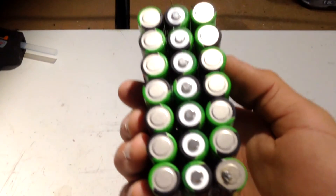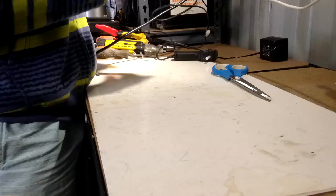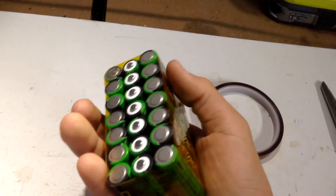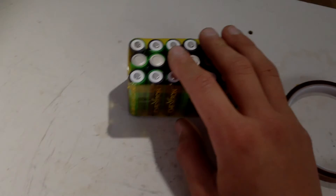The pack is nicely glued together — not exactly straight but it's a nice solid pack. Now I'm going to wrap some tape around it and get the bus bars put on. I have the pack taped up in Kapton tape and it looks quite nice, a lot more professional than duct tape. Credit to Rinoa Super Juniors for the duct tape idea. With the bus bars on and remaining tape applied, it should give good insulation and keep it electrically safe.